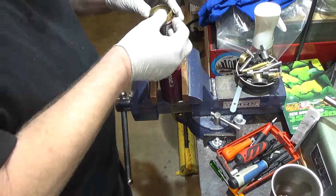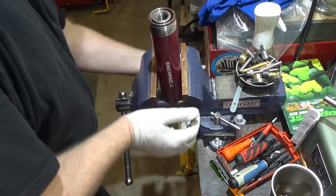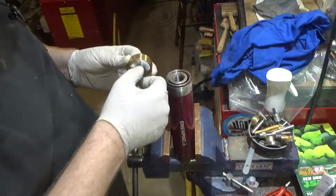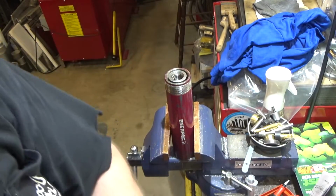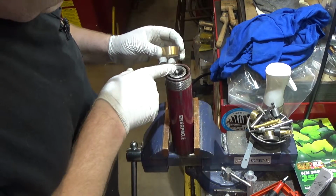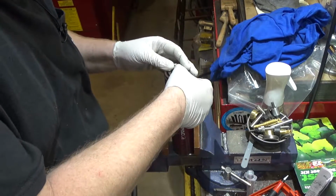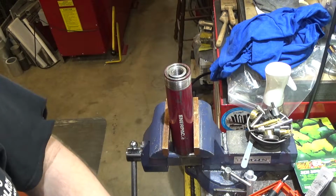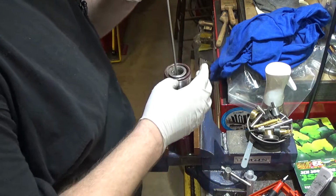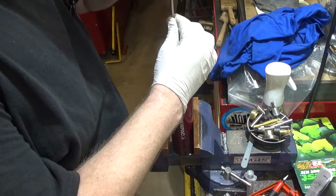Now this guy keeps this whole thing centered, and is also a sort of bearing guide for the outside. So of course we drop it on the concrete. That's just wonderful. Has a beveled side which goes in. Got to make sure it's clean. This hydraulic fluid really makes everything so slippery, which I guess is part of what it's supposed to do. But okay, there we go. And now I can bring this guy, the spring tension part, back.